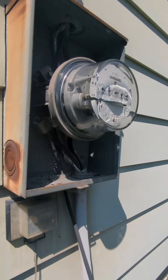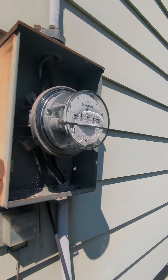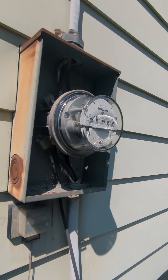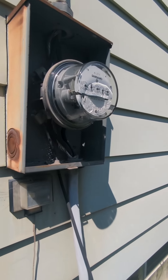That has happened to me so many times where I've literally had to rip these out because the thing got seized in there so bad. Greasing it helps with continuity and prevents potential heat buildup, high resistance, or a higher electric bill. Just grease and NoLox as much as possible whenever you can.